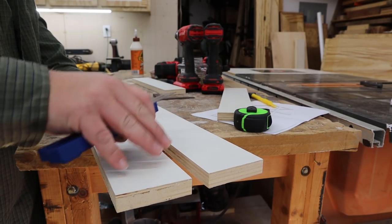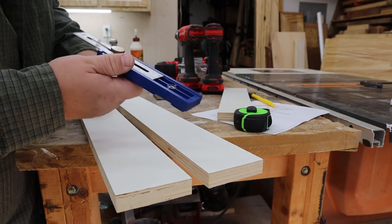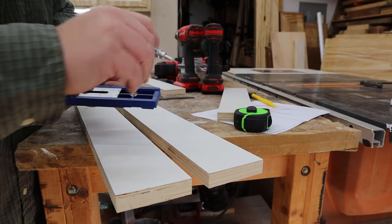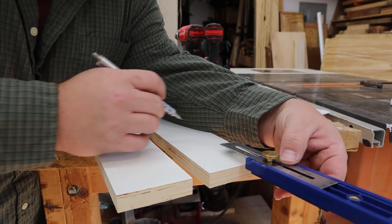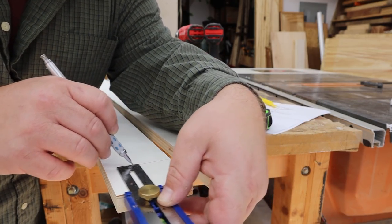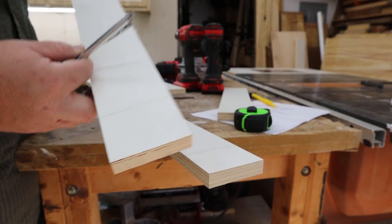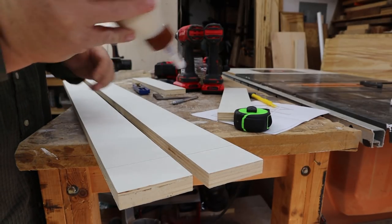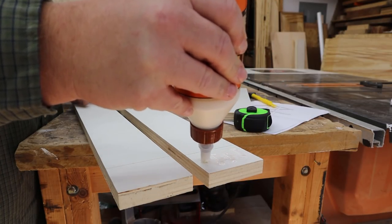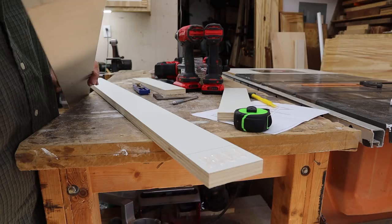Here's a look at how I'm marking and putting glue on these sides. I'm using my Kreg multi-measuring tool — this thing is really cool. I've got it set to the depth that the L-brackets, or the corners of the legs, cover, and so I just run this down each end and I know exactly where to put the glue. I'm using Gorilla wood glue because it's white — I like the fact this is a white glue instead of yellow, since this plywood is majorly white.